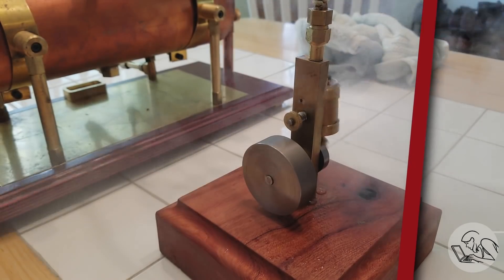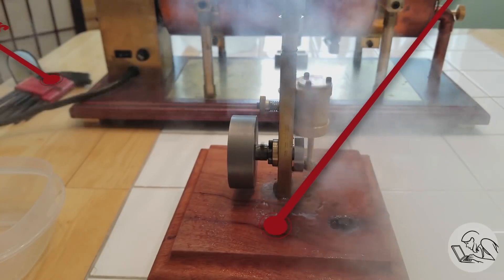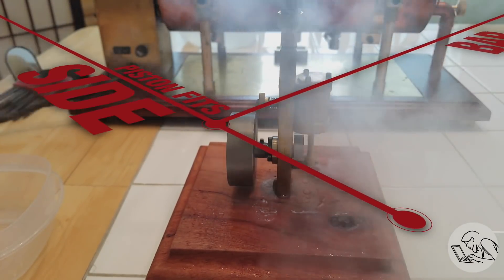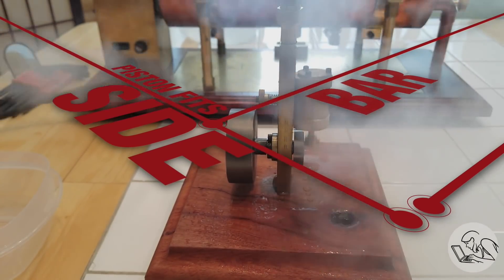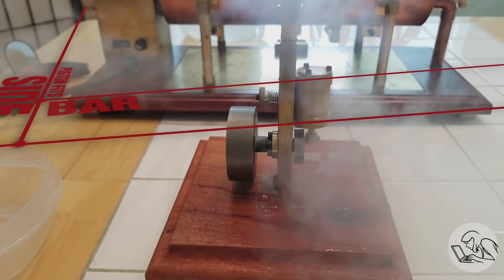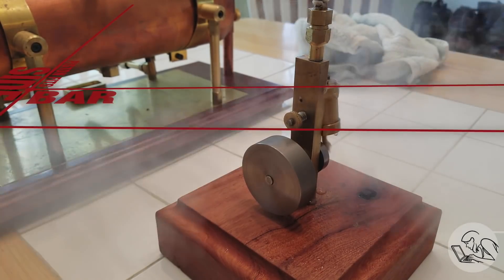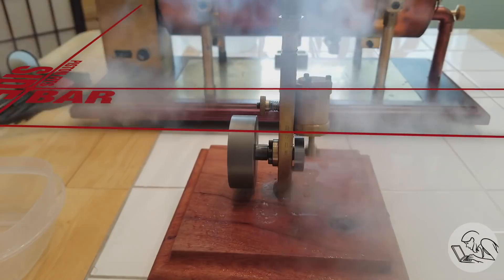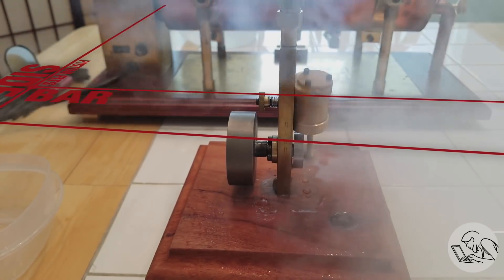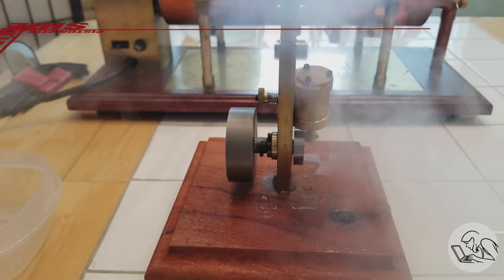Sidebar on piston fits. Internal combustion engines are typically RC6 for the piston on the bore — not for the rings on the bore; the rings are much closer because they need to be a gas-tight seal. For ringed piston setups, the looser RC6 fit gives them the temperature range they need, and the rings can compress in the grooves. For a ringless piston fit, you want to be somewhere in the RC3, 4, or 5 range. A good approach is to aim for RC2 — you'll likely miss it a little and end up in the RC3–5 range, which is a good compromise between room for thermal expansion and sealing against gases, particularly for steam engines.